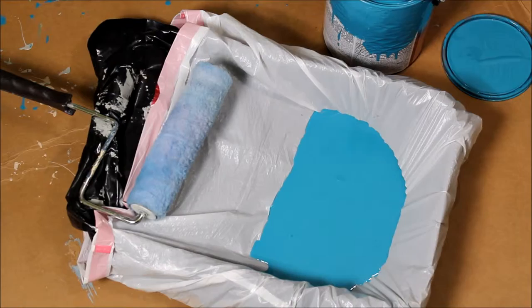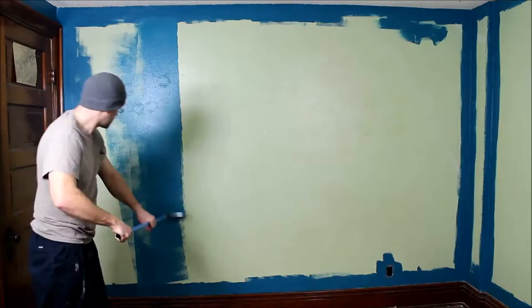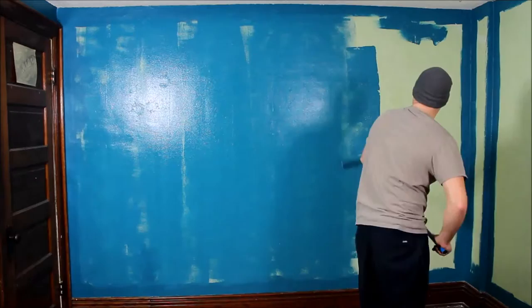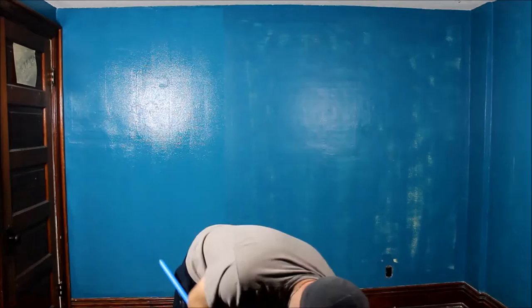When you go to roll out your walls, pour enough paint in your tray, get enough paint on your roller, and a nice trick is to twirl your roller just a little bit to minimize drips. I also have cardboard down when doing this so I don't spill anything on my floor. I'm going across the whole wall and putting a nice light coat of paint on first — not working in a W fashion, just going straight up to where I cut in, straight down to where I cut in, over a little bit, and repeating. Then I go back over everything with a little more paint on the roller for the final coat. Depending on your walls and paint type you might need one more coat, but this is a pretty fast and effective way to paint the whole room.